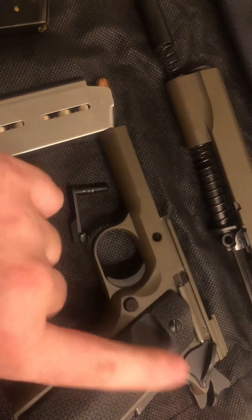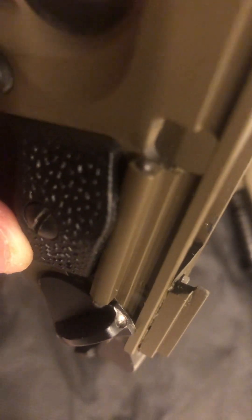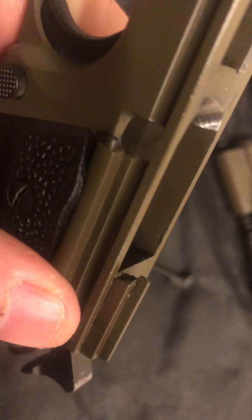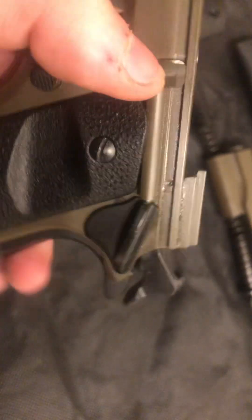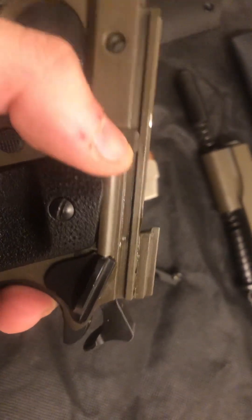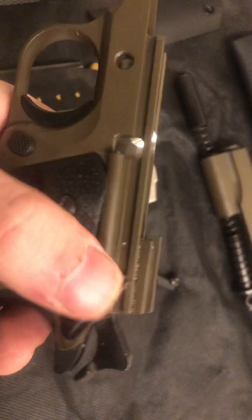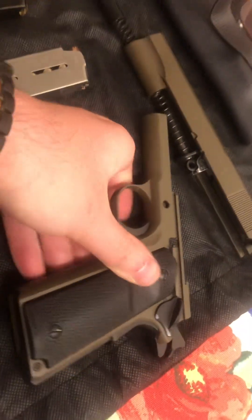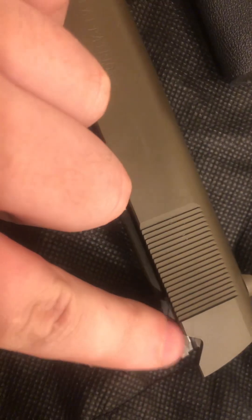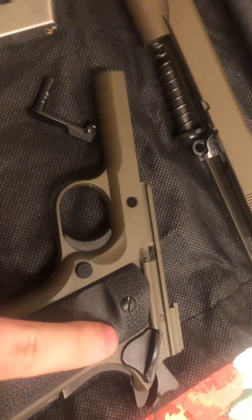The thumb safety — I did have an issue with it. The way this is made, there's actually not a detent hole there. You can see on this one there is a detent hole because I did that myself — I drilled that detent hole. Normally it's kind of a squared-off flat. The detent retention was really bad. You can see how it gets caught in that middle position. Now this won't show correct detent retention because normally the spring would be pushed in by the slide stop. So normally you'd have tension there. But I would get caught in this middle position — not enough to put it on safe, but enough for this corner to fall in there, so the gun would fire but would not cycle. It never happened while shooting; I noticed it before I shot the pistol and drilled the detent before taking it out. Never had any issues with it after that.